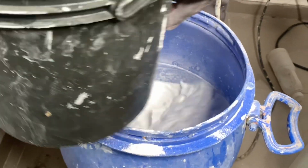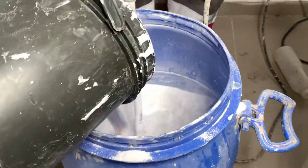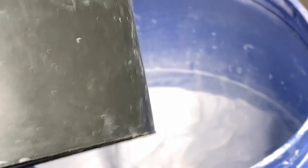And when using acrylic, the type of acrylic matters a lot because acrylic comes in solid and liquid content. Like I always told you guys, most of the cheap acrylic is at 40% solid content. Well, I like to use acrylic that is still cheap but 45% solid content. So in this particular formulation, I'm using a particular acrylic called Sinapol, and the Sinapol I'm using is in the styrene acrylic family. So it's very solid. It will give a very solid bonding strength to the formulation.